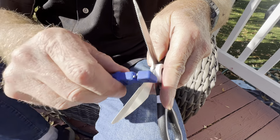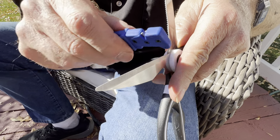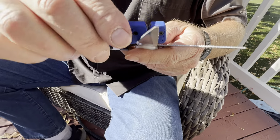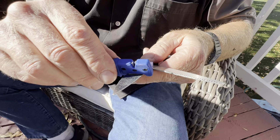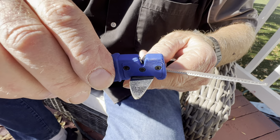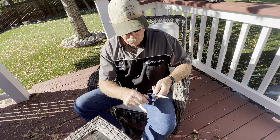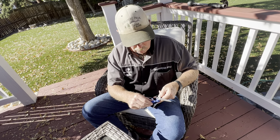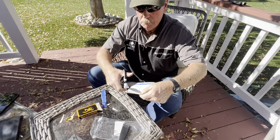I can feel there's no burr at all on there now. So we turn it over and do the same thing on this side. This is a little wide right here, so it'll work — I just have to slow down and turn it. We want them parallel — not up this way, not up that way — parallel flat like that. Reach back in here. There's a little catching here so you have to manipulate the sharpener just a little. Come right on out — okay, the burr is gone.